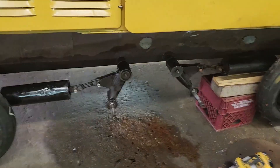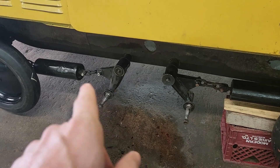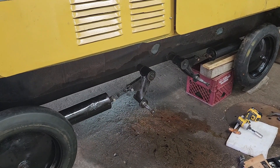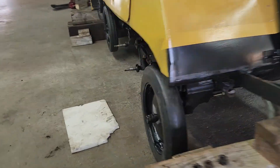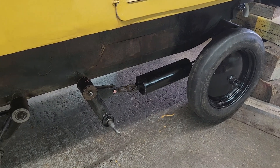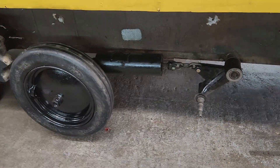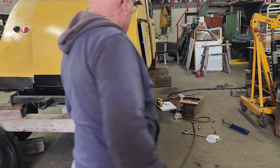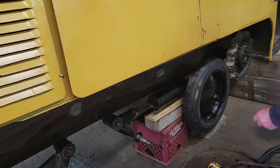Hopefully this is the last day I was late showing up to the shop. We've got two bogeys installed on this side. Like dad said, he had to replace some of the chains, sanded down the bogeys, repainted everything, re-inspected and replaced all the bolts. He got this side done as well. I'm going to get dad to explain the bogeys. What size castle nut are you using on this one? Three-quarter inch castle nut - that's outside - half inch bolts.